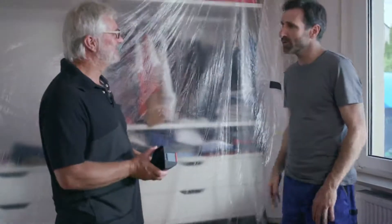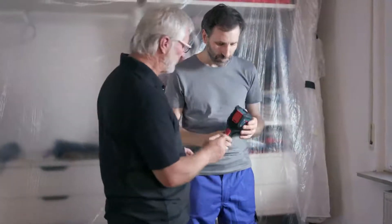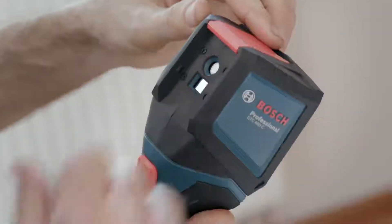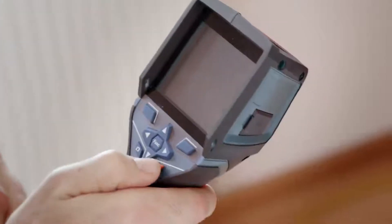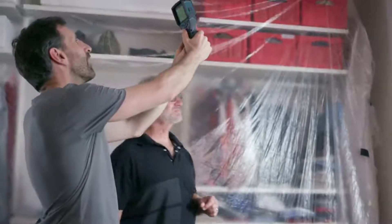Joachim, we're looking to modernize the whole house, so I need to check every room for thermal bridges. I'll pass the GTC over to you. First, you need to open up the protective guard on the front — this flap needs to go up. Then the lens is exposed and then you turn the device on here. The camera will start up now and it doesn't take very long at all. Then you're ready to point the camera at your roller shutter box and start scanning.